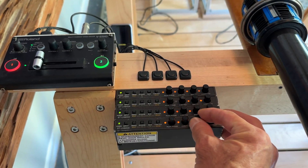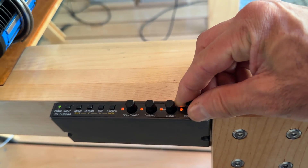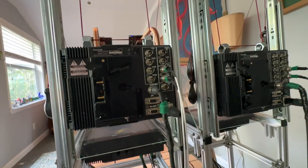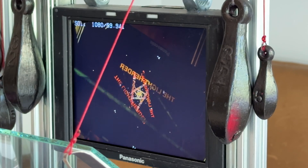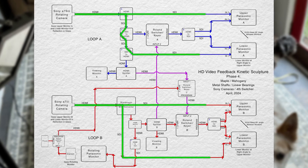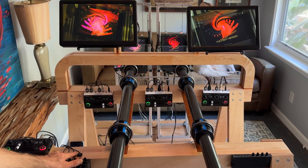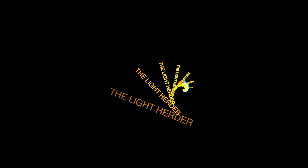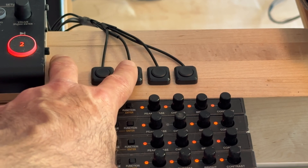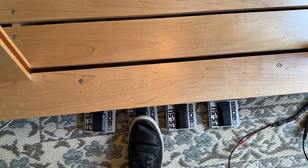The monitor control modules are here — this is where you change the hue, brightness, saturation, and contrast for each monitor. The rotating front monitor's control module is here. Each monitor has two inputs being used, and you use the control module to set those inputs. Input 1 on each monitor sees a camera directly. Input 2 sees one of the various switchers, and the switcher has the option of seeing the camera or something else — this allows something else to be mixed in with the feedback. Each switcher uses one of these buttons to switch between inputs, and you can also use these foot pedals to do the same thing.